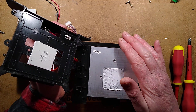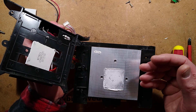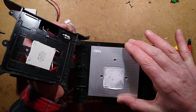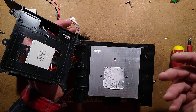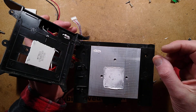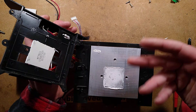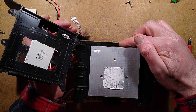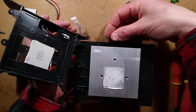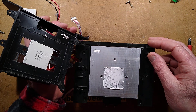The device inside is an MT Tech Thermoelectric Cooler — part number 12705T125BC, made in 2018, so it's not that old. Interestingly, this runs on 12 volts, which means if you had a remote cabin somewhere with a humidity problem, you could put up a 12-volt solar panel just dedicated to this. No matter what level of sunshine there was it would just run at whatever speed, continually taking moisture out of the air — particularly if you added a little drain pipe to the drainage unit or just had it plumbed to a pipe.